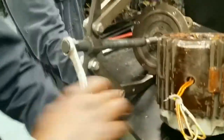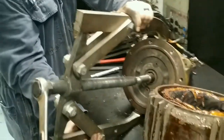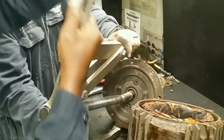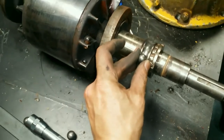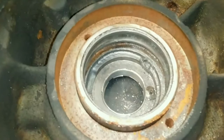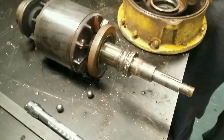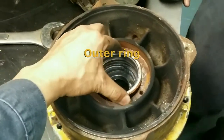We are using a big bearing puller to pull hard because it didn't come out easily. It's coming out. It was so bad that the bearing broke off and both bearings are just falling off. That is a bearing cap holder. This is the bearing itself — it's stuck in there — and the other part is over here.